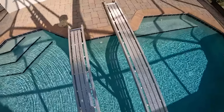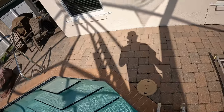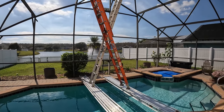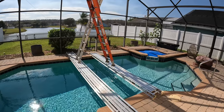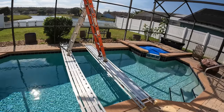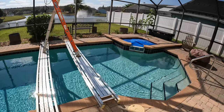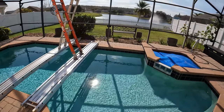There's the whirlpool. I'm going to work my way across, step off here. These stages are 250-pound rated, and I'm at 240 plus the ladder, so I'm right at the limit. We'll get some flex when spanning 14 feet with only a foot on each end. So I'm definitely going to get a 20-inch wide, 16-foot long, 500-pound rated stage so that two people can work and we don't get any flex when crossing the open span.